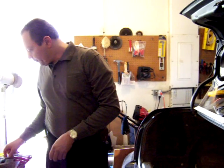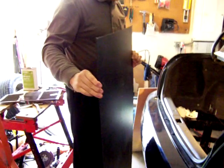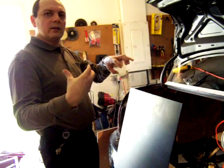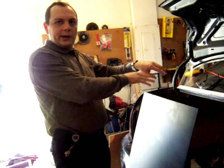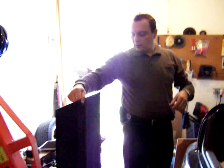I also bought some plastic PVC sheeting. I'm going to put that under the car — under the battery racks — and on the sides. The idea is to enclose the batteries so the fan blower can really suck air from the front to the back and extract any potentially dangerous gases that accumulate when charging.